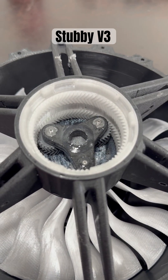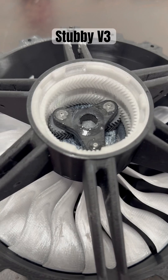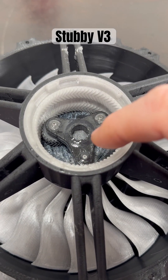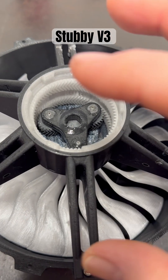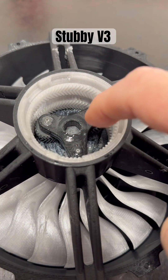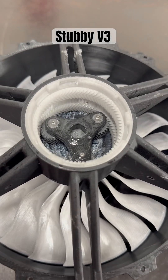We knew the sun gear failed first. Now that they're all nylon 6, let's see if the sun gear fails again. If it does — metal parts, that's where we've got to go. If it doesn't fail, or if it tends to strip out the planetaries, then we know the nylon's working. But if they all strip out evenly, then we know for a fact it's just got to be metal.